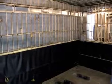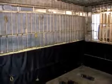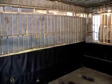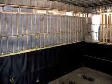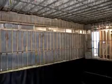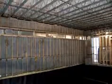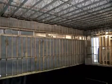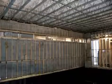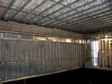You'll also notice that there's electrical, audio-video stub-out wires coming through the wall. Anywhere there's a penetration, we will pump Acoustiblok into the penetration to seal it permanently. We will continue this all the way up this main wall. We'll end up being 5 or 6 rows high, which in turn will give us 5 or 6 taped joints. Then we'll continue on to the ceiling.